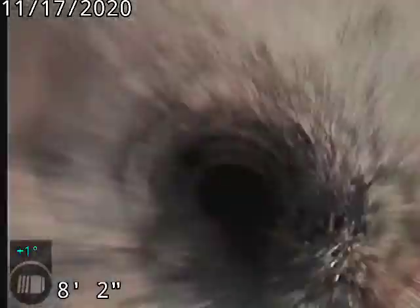1635 South Umatilla. Sewer line has been cleaned, tested, and inspected and is flowing well at this time. Sewer line does have grease and sludge buildup throughout pipe — hydrojet is recommended. Also, there is broken tile pipe at 16-foot and a crack at 28-foot. Possible repairs needed.